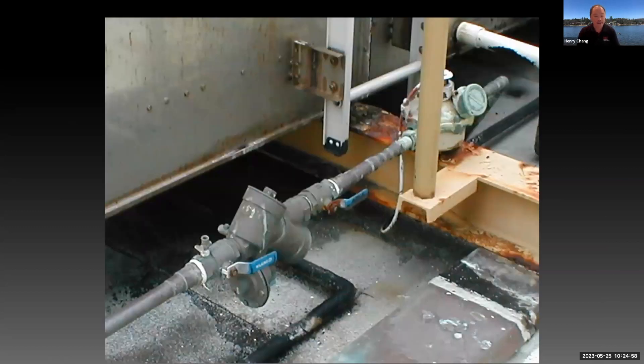If you close that shutoff valve to shut the water down, you're shutting off the makeup water line or water line to a piece of equipment. If they're not aware of it and the equipment is still running, water stops flowing — you could burn the pump, damage the equipment, things like that. So it's critical that you notify the customer that you're going to be shutting the water down.